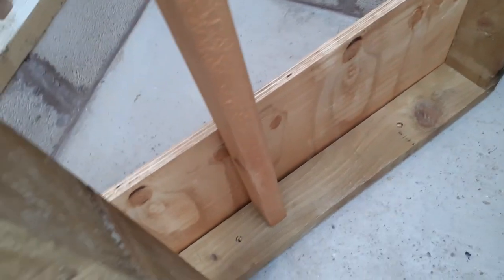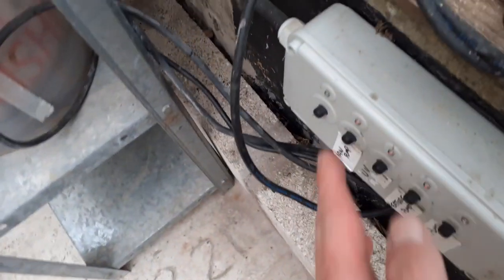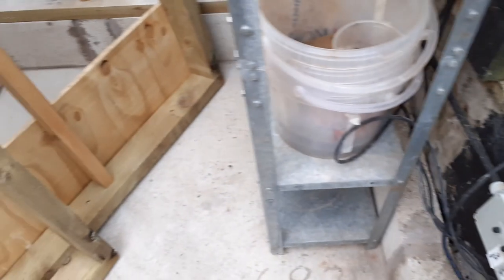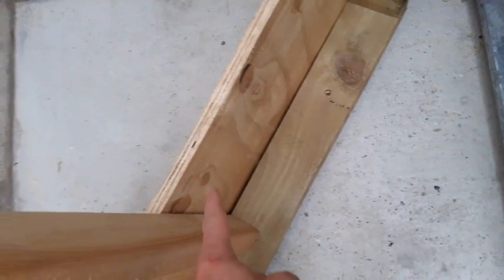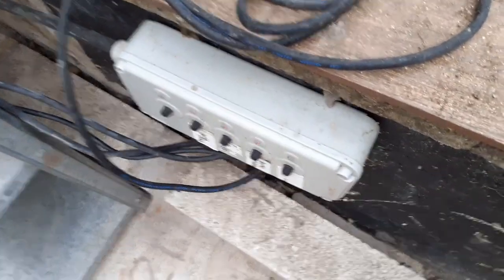What we're doing is putting some plywood on the bottom — I'm hoping it's not too thick but I might have to change it for thinner plywood — so that can cover that area and then I can clad from there upwards. I might even just keep that bit as plywood, get thinner plywood, then feather edge up on that side and then it can go four lengths across. I don't want a gap.